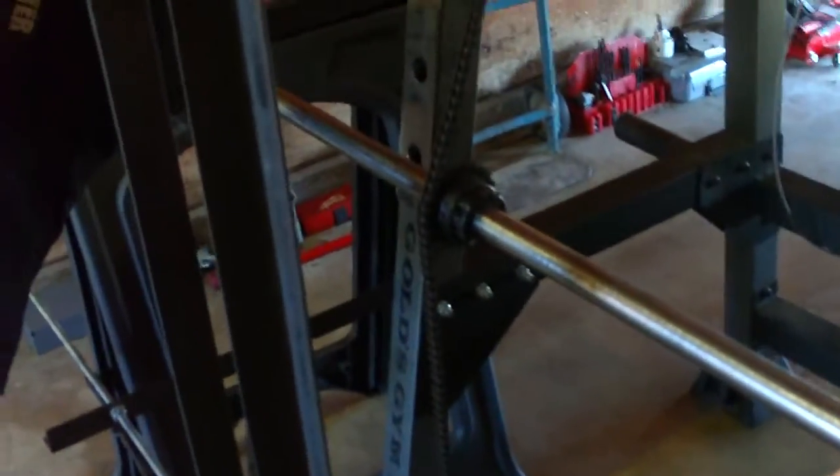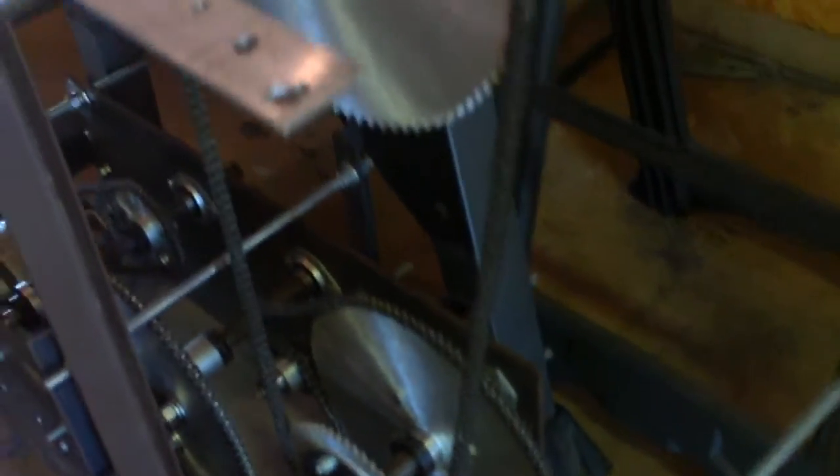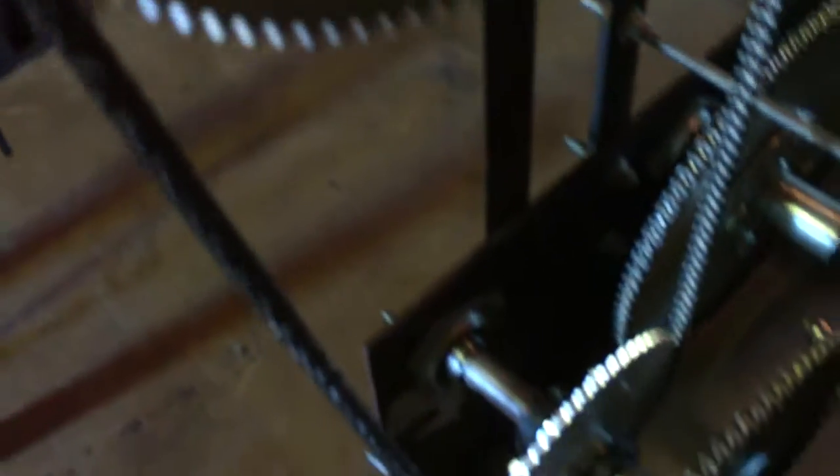There are some things I've got to figure out. One is making sure I don't have any chain tensioners involved with the main shaft going across here. I'm avoiding chain tensioners at all costs — I learned some lessons there and chain tensioners are a pain. So there are two chains: one that runs down here which drives the shaft, and another one that drives the gearbox. How do you get two chains on the same axle tight, with very little or no slack, without chain tensioners?